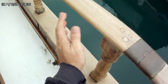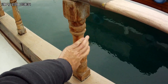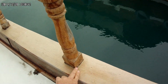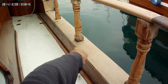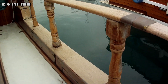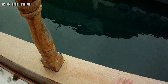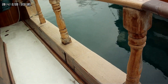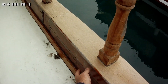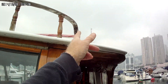After the first of the year, now that all the old varnish has been removed with heat, I just need to get off the oxidation and sand everything down. Then I'll tape it off, get Sikaflex into a few places, chisel out some wood and fit teak blocks with teak epoxy, then seal around it and sand. It's been about 60 days and the teak is already oxidizing again, but at least it's oxidizing evenly.